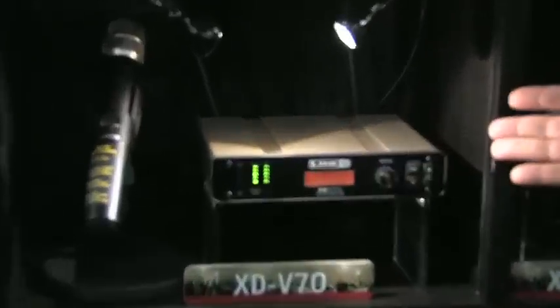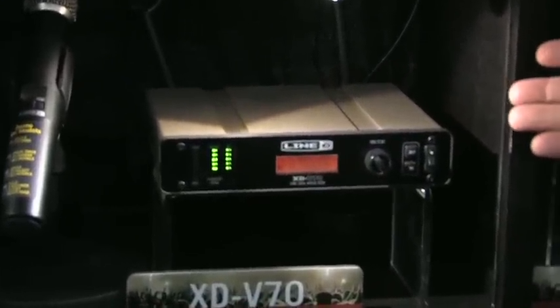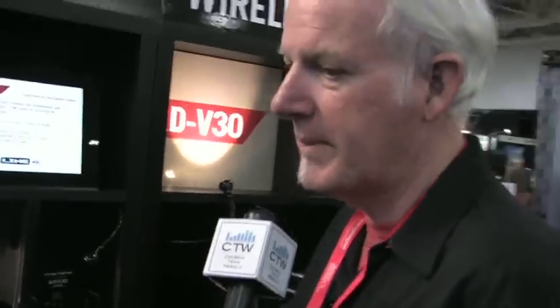There are no changes coming in our band, unlike the other guys. What we have here is a digital wireless microphone. You can run 12 simultaneous channels together. We have a handheld microphone, a belt pack with a lav, and a series of headsets. The microphones use a standard TA-4 connector, so you can plug in anything wired up with the Shure standard. If you're using Countryman or DPA or your favorite microphone, it will likely just plug into the belt pack.